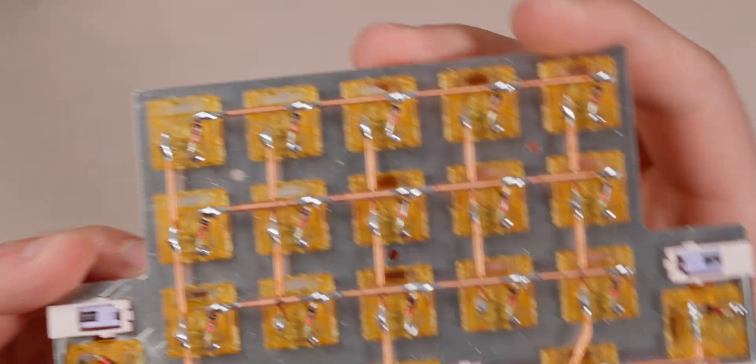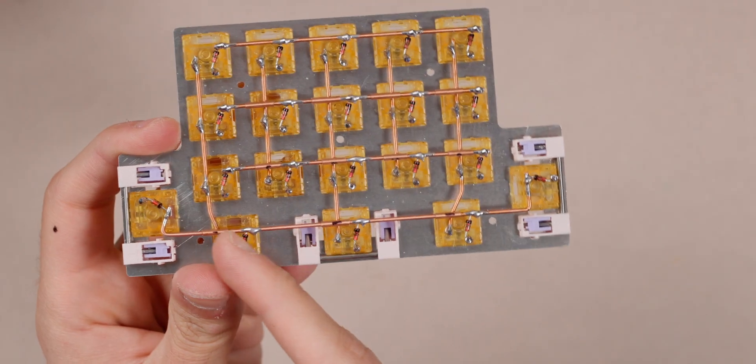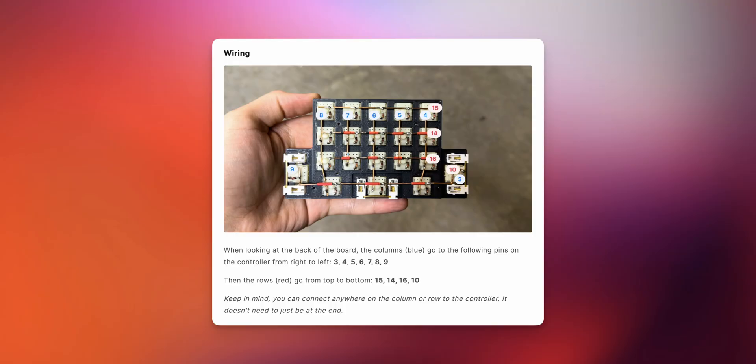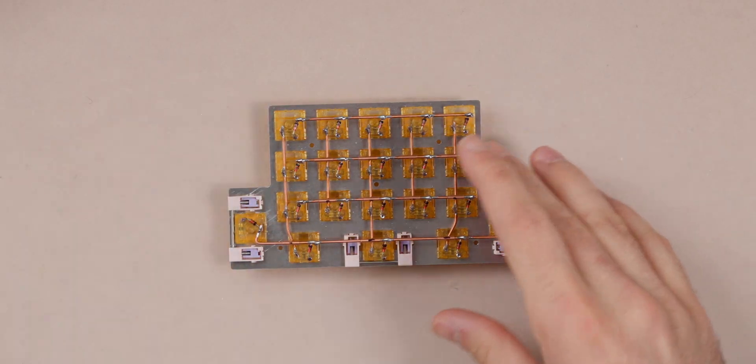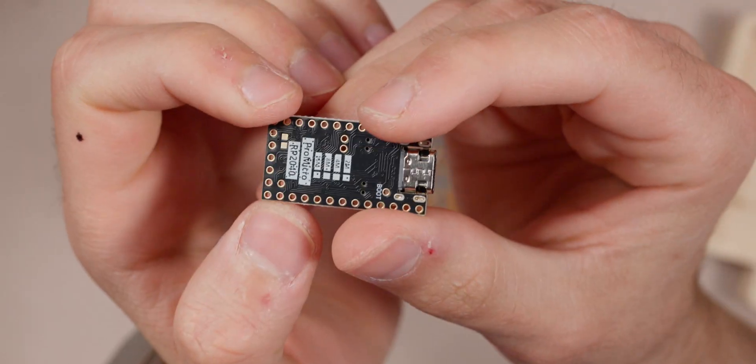The matrix is all wired up — all the diodes running to the rows nice and neatly. The Scotto Frog uses a seventh column for that bottom key rather than wiring it into the five-column layout, which just makes it easier. The files for this are available for free in the description — you can 3D print or CNC the case. My website also has wiring diagrams. I'm using an RP2040 Pro Micro — great controller, super affordable on AliExpress, USB-C, 16 megabytes of flash. I'm wiring everything to it now.